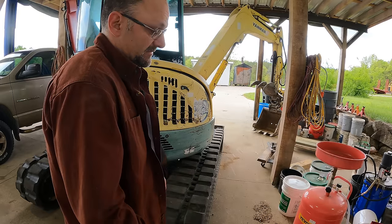All right, I do not have it back in its original configuration. I have the pumps flipped because I think that way it deviated to the right, but not quite as bad. Those pumps are supposed to produce the equal, you know, I keep saying pumps. It's really one pump in there with two isolated outputs. So the output of this pump is not going to affect the output of the other pump, regardless of what's going on. But it's really one piston pump in there that just switches between two different outputs as it's spinning around. So it tracks to the right in this configuration, but not as bad as it tracked to the left previously. Interestingly, it seems to go quite straight when I first turn it on and run it while the oil is fairly cold. But as the oil heats up, then it goes more to the right. In other words, as the oil gets hot and loses its viscosity, I'm getting more internal leakage and it's causing the problem.